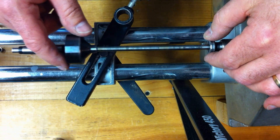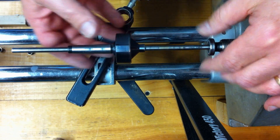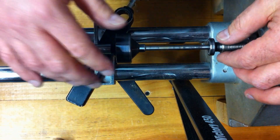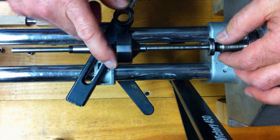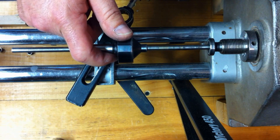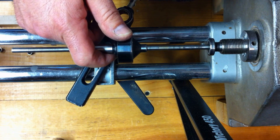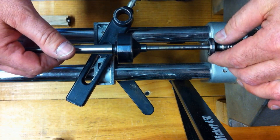The other nice thing is you don't have to use as many spacers because you can adjust this up or down — you just bring your tailstock up, lock it down, tighten it, and you're good to go. This will cost you about $10 more than a standard mandrel, but I recommend it because I bent mine and now have to spend $7 to buy a new mandrel rod.